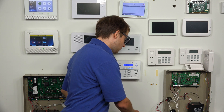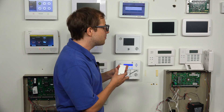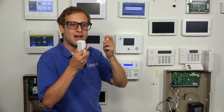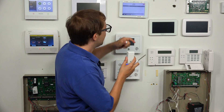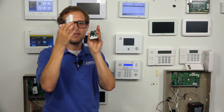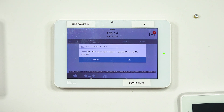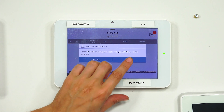The way we're going to enroll it is by activating the tamper switch. I'll open up the sensor — remember, we have this small tab, we just insert it and pop it open — and that's going to trigger a tamper. You can see sensor CEBAA8 detected, and that matches the code on the barcode right there. So that is the correct sensor. We're going to choose OK.